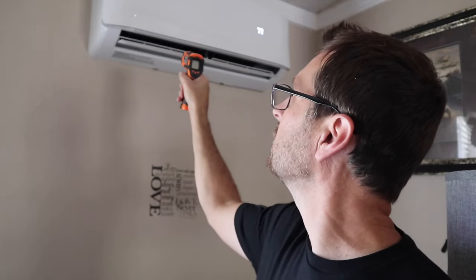We're here inside with the head unit for our main space. Admittedly this unit is a slight bit too small for this main space, but it still does a great job. The temperature of the air coming out of here right now is fluctuating between 48 and 50 degrees and our unit is set at 77 degrees. My total square footage for the house is just a tad under 1,800 square feet and I have four head units in the house.